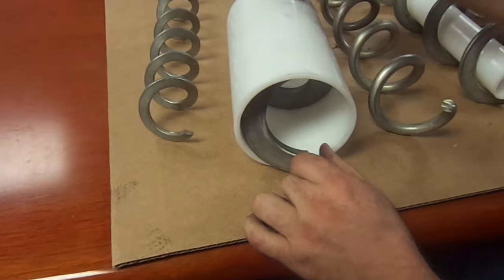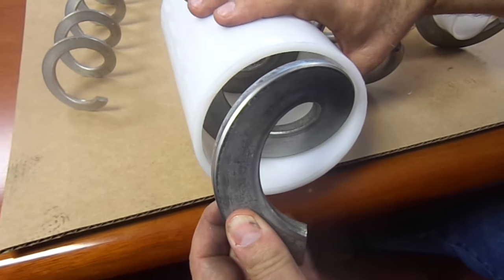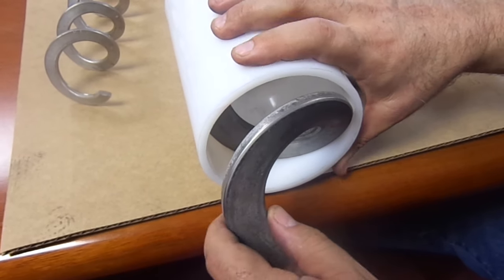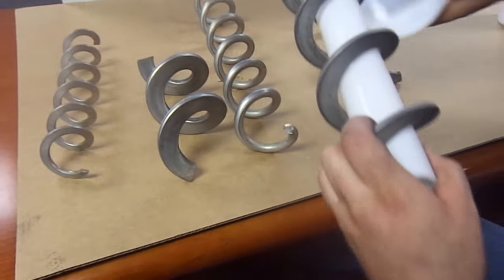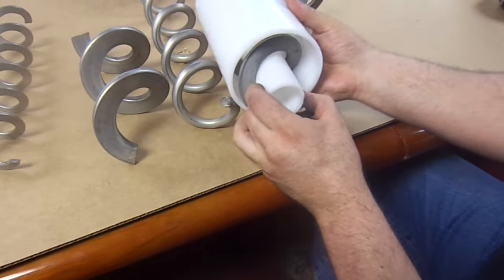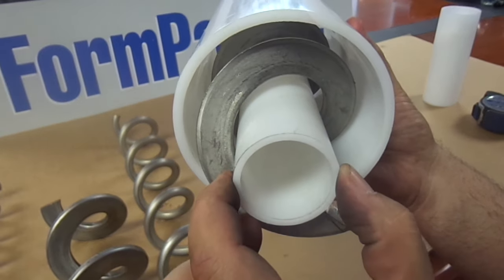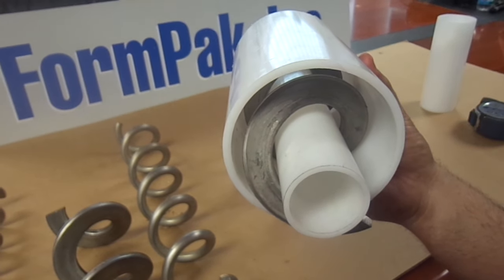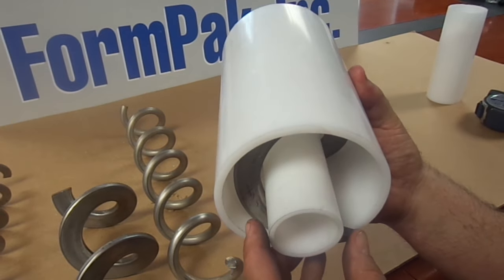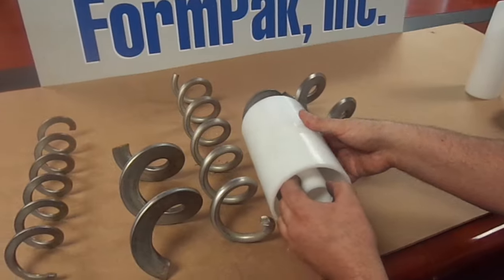In most situations an auger and casing is all that's needed. This auger and casing combination has very little side-to-side flexible room — it could jam, but it's probably not going to be used with anything that would jam. It would be used with granular material that it would churn through really nicely. In a customer's requirement that backflow is prevented, we use the center core. You'd have a four and a half inch casing with a one and three quarters inch center core, and the ID of the auger is two inches. This goes together nicely, keeps the material moving and prevents back flow.